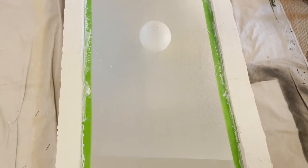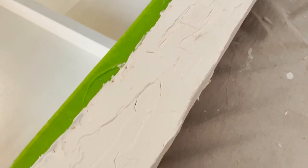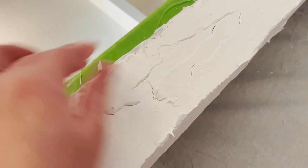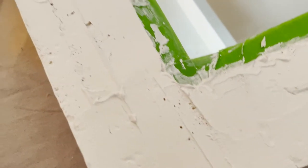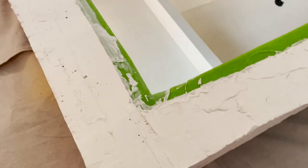This is what it looks like at the end of the first coat. Checking in — it's been a couple days since I did the first layer of the joint compound and it's looking a bit cracked in some places. There are a lot of bumps and raised areas that are kind of sharp. So I'm going to scrape that down and then we're going to do another layer, and then we'll get ready to paint it — I'm still deciding between some different colors. I'm just working in the living room because that's the only space we have. As you can see, lots of cracking. I want to do another layer just to fill in all these little bubbles and holes that were in the foam and try and get it nice and even and ready for paint.